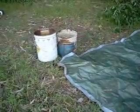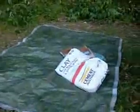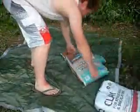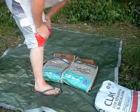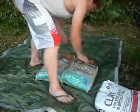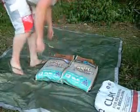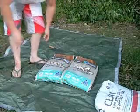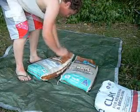So here's the ingredients for the next job. We've got some buckets there, steel buckets. We've got some clay. Sand. Green sand used for casting and for what do they call it? Refractory sand for making the heat resistant internals. It's basically sand, about 6% clay.